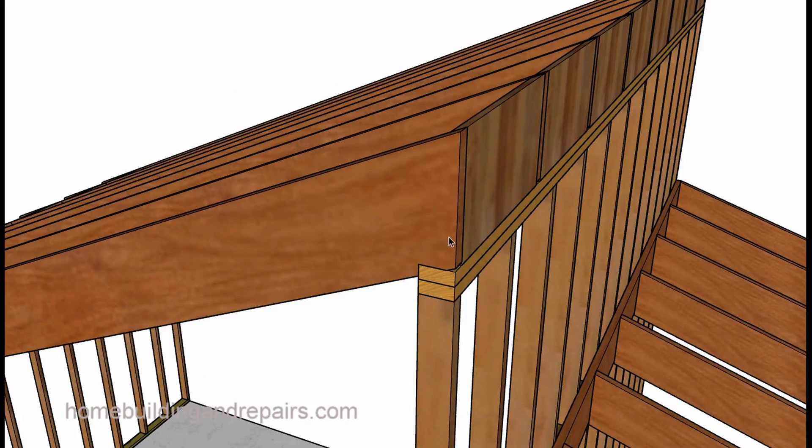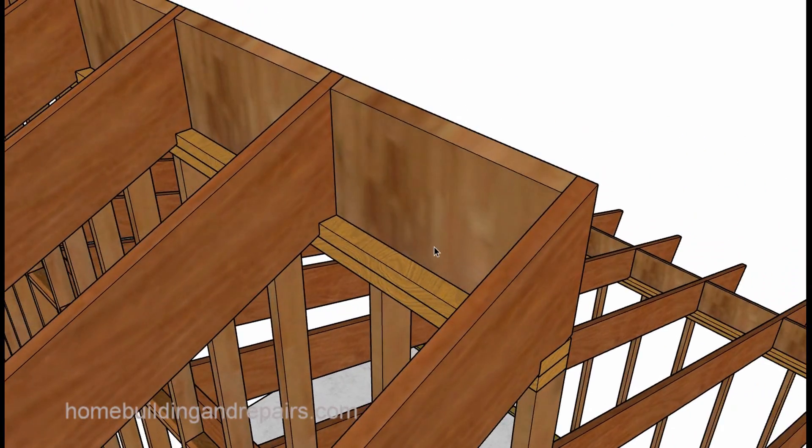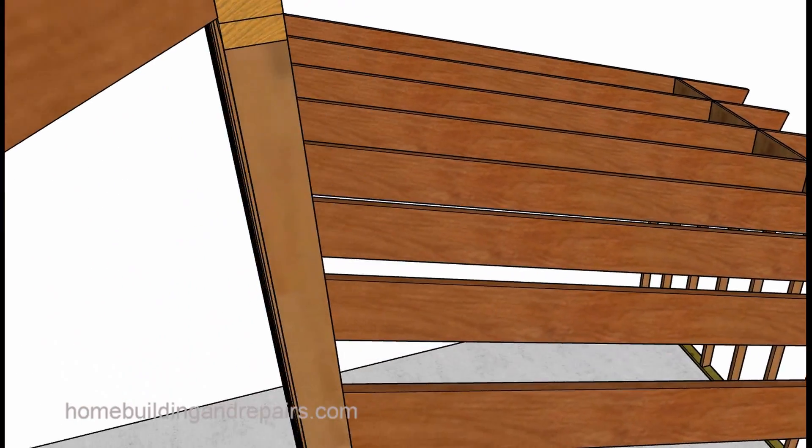The upper block would look like this. It'd be nice to have it shaped, if possible, so that it can be nailed. You'll be perimeter nailing it. And this block right here would toenail in from the other side, and then you would nail it into the rafters on each side, probably with 3-16D nails.